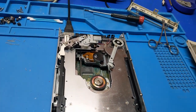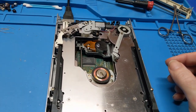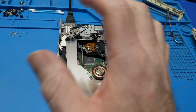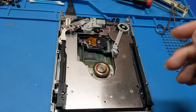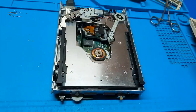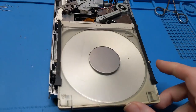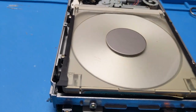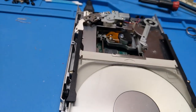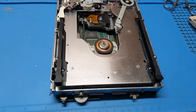Like I said, there are very limited places where you can substitute ceramic for electrolytic and vice versa. Servo circuits are precision enough that you've got to use the right technology capacitors when you're recapping. And this is why — right here. But the servo is not nearly as loud as it was before, so let's keep plugging forward.